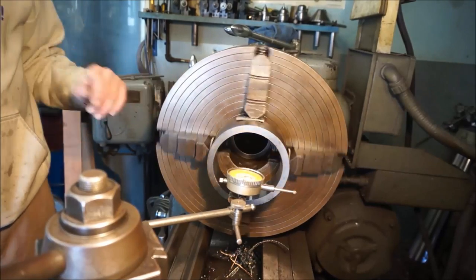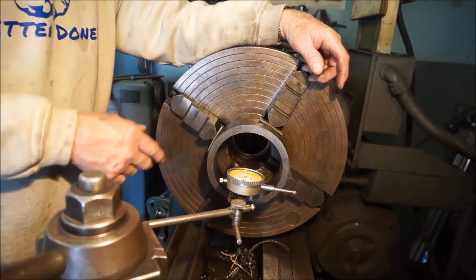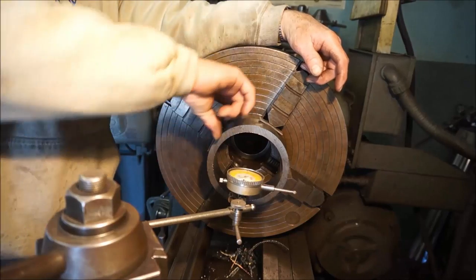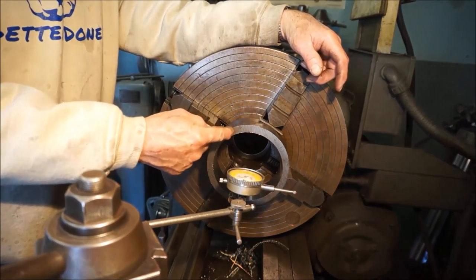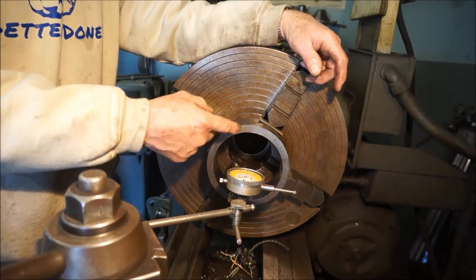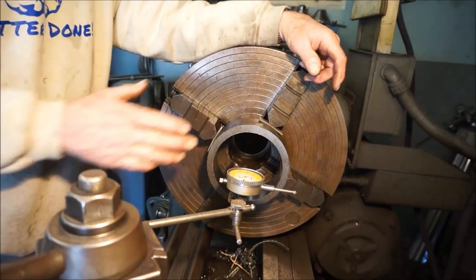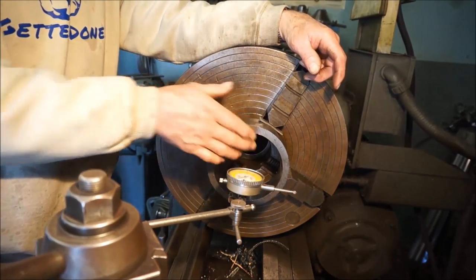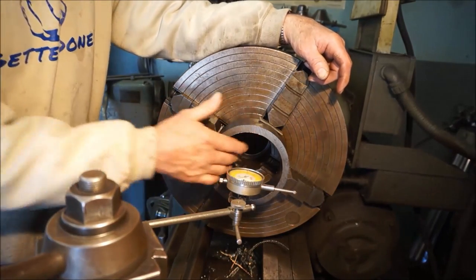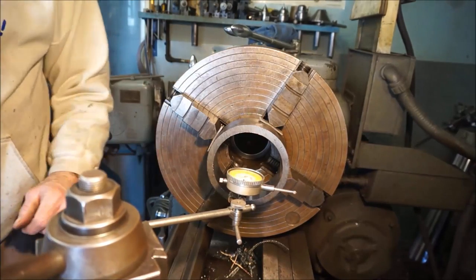Be happy with that. All right, after our first cut, you can measure the width right there and you can actually see how far you are out. And if you wanted to, you can measure that and write the plus or minus on the amount of thickness around there. Then you can put your indicator right on there and dial the imperfection into your new clean face, and then you'll be able to parallelism it without having to reach on the back side. Or you can get an indicator that has a finger that can reach in and grab the back side of your part, and then you can tap that true.